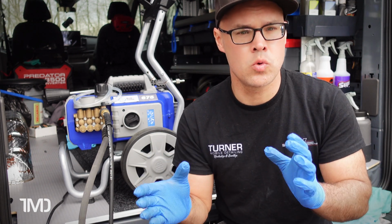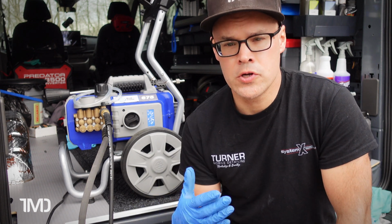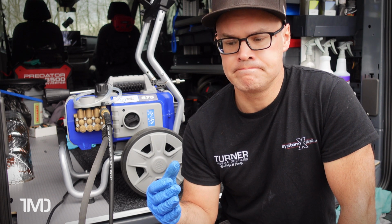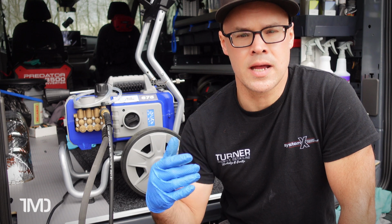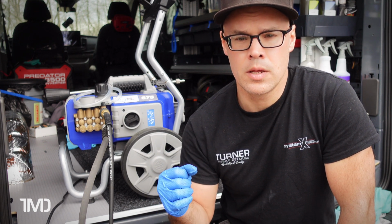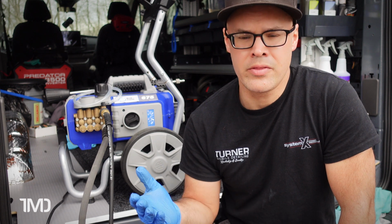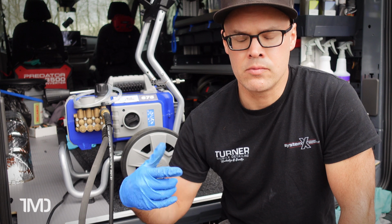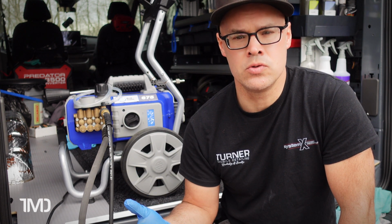It's got some little quirks that most, if not all, electric pressure washers have, like when you first use it, when it's cold, the motor is cold, it kind of wants to continually pressurize itself. The motor wants to just kind of warm itself up a little bit before it gives you full pressure constantly. But other than that, you run it for a few seconds, 30 seconds, let it repressurize, let off the trigger a few times. You'll kind of learn it as you go.